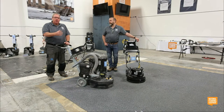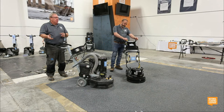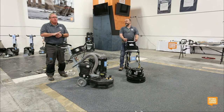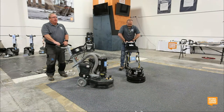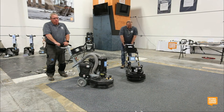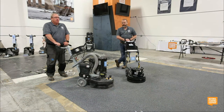I could change my direction. So if I'm using diamonds, I can run forward for an hour, and then I can take a break and turn it off, and then put it in reverse for an hour. A lot of guys think that really helps with diamonds wearing evenly. I don't know if I'm a real big believer in that on the smaller machines. On the bigger machines, I see a little value to that. If that makes you feel better, you should do that. Me, I just put it on forward or reverse.